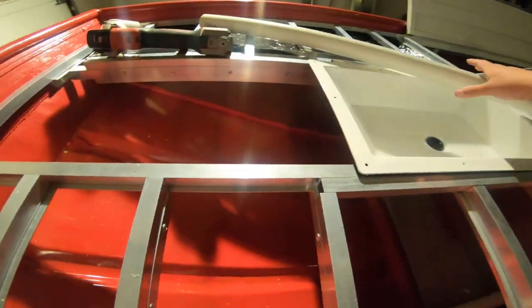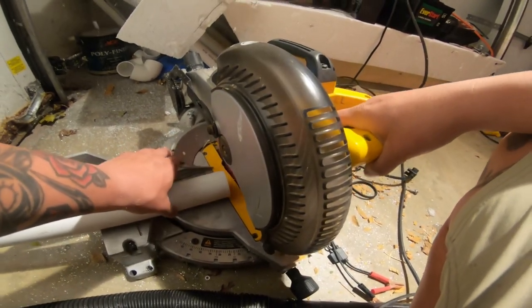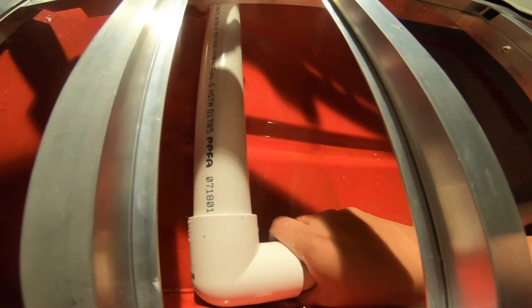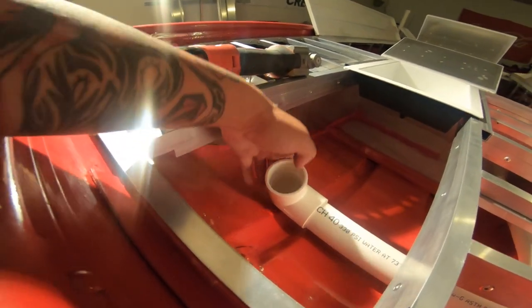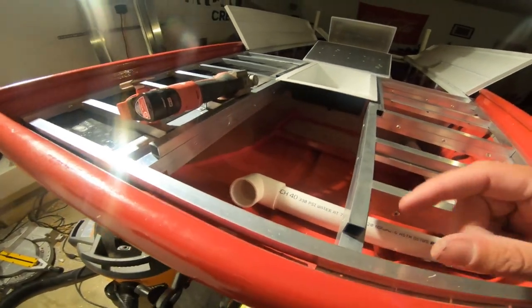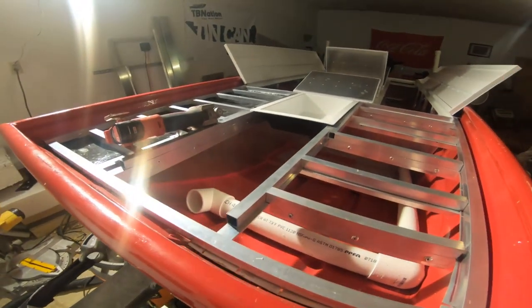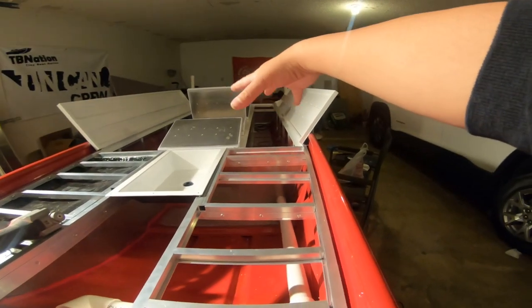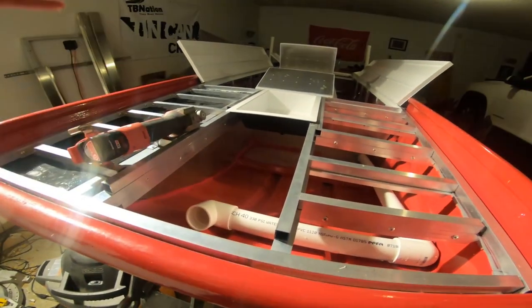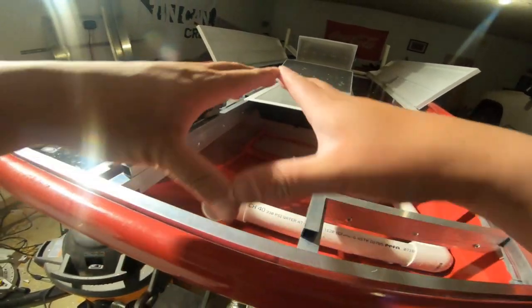I need to cut a piece of piping to make it in the center of the boat, shove it in the pipe. There is a pipe all connected. This is just a passageway for all the electrical wiring. Up here I'm going to have headlights, fish finders, nav lights, the trolling motor — all that stuff has to be wired to the batteries. All those wires are going to come through this PVC pipe and come out right here. I need to do that now before I place a deck on or else I can't. The top deck will have little holes and grommets where all the wiring comes up wherever it needs to be. This pipe is one-and-a-half inch schedule 40.